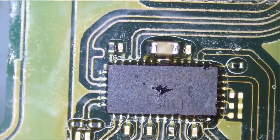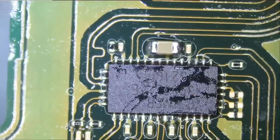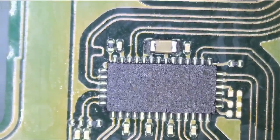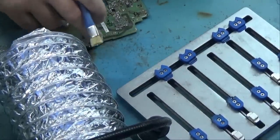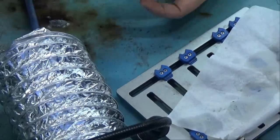We should be all good. The soldering is better than factory and we should be good. If all is good the console should work — one way to find out. Let's also clean the rest of the board because I see flux in a lot of areas — whoever worked on it before did not do any cleaning. The USB-C port has also been soldered on by the other person who worked on it, so we do not know if it's soldered on properly or not.